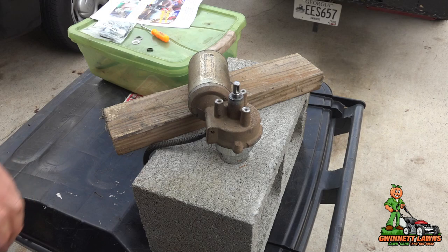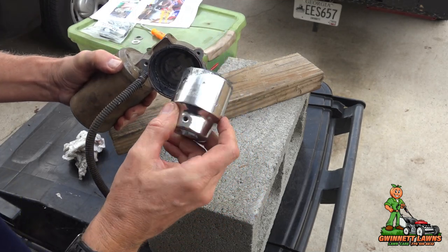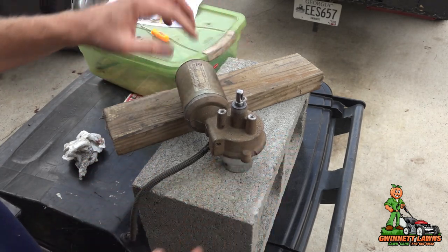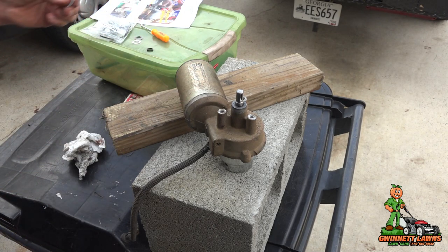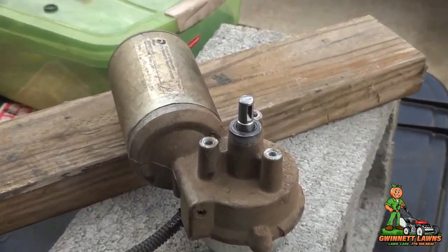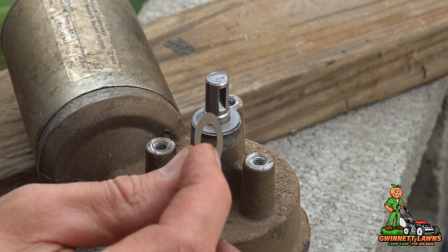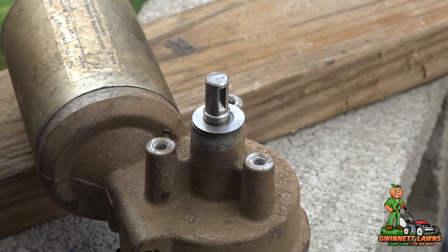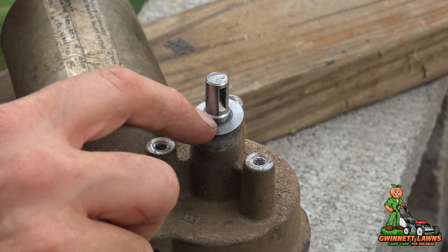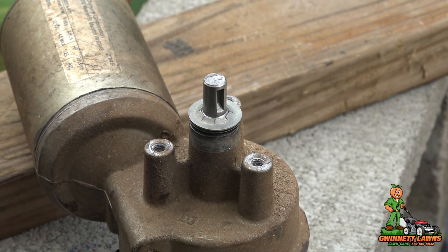So here's my little makeshift workbench so you guys can see it easier than if I was on the floor. We've got a rubber O-ring in. I just basically took this socket — this is a 1 and 13/16ths — you just need to get something that will hold the gear stable. Then I have just a piece of two by four right here, and it works absolutely perfectly; it holds everything level. The directions say we need to take the plastic washer, then the metal washer, then the spring washer and put them on the shaft. The spring washer is not going over the shaft because it's thinner here and then tapers down, so we want to take a socket and very gently hammer that down onto the thick part of the shaft — we can use a 15 millimeter.